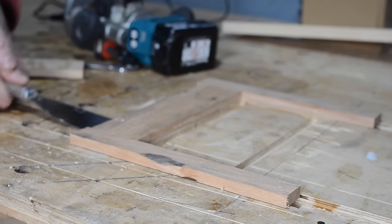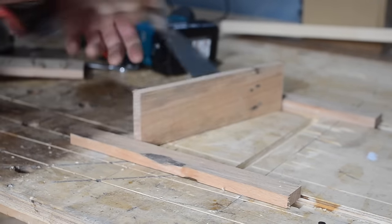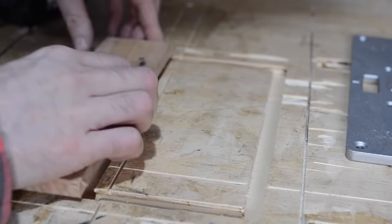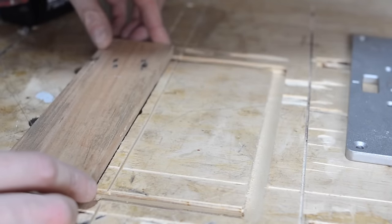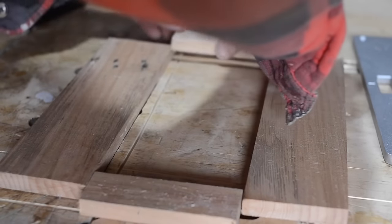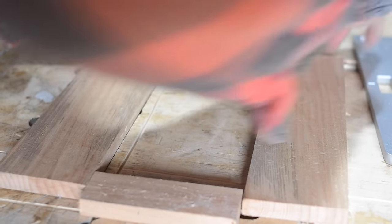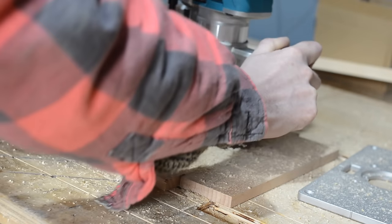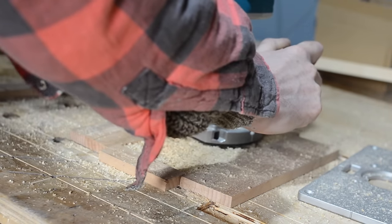This first groove I've cut is the depth of the router plate so the router plate will be able to sit on it. But I need it to be a bit wider, so I remove those bits of wood, move them to the edge of the cut, and then glue them back on again. I just have to trim down the two shorter bits so they fit in the smaller gap, then I can run the router around again and widen that little shelf.